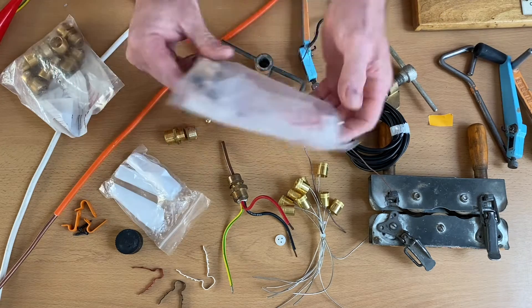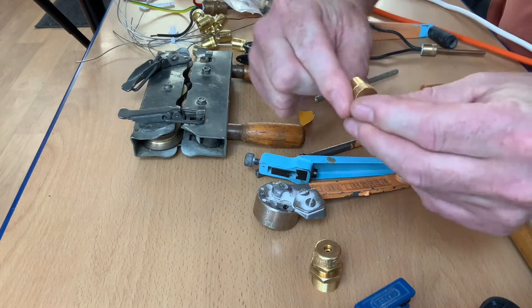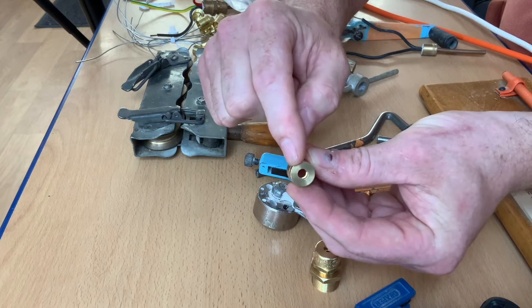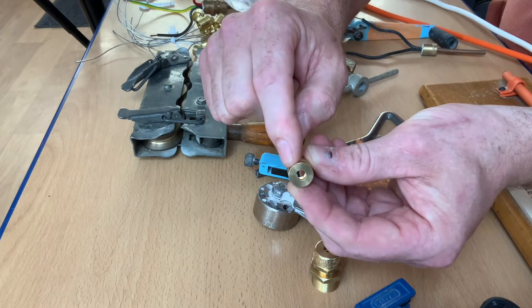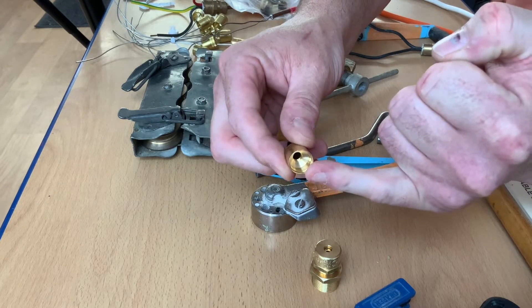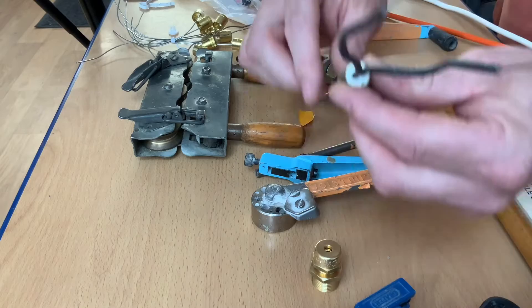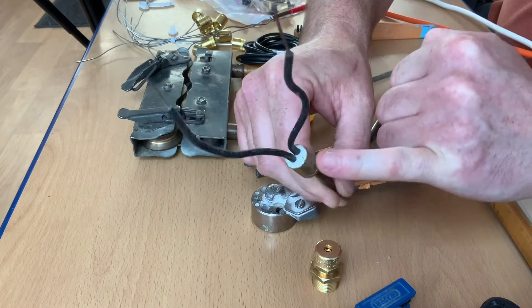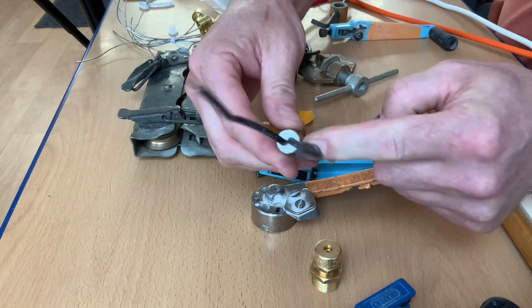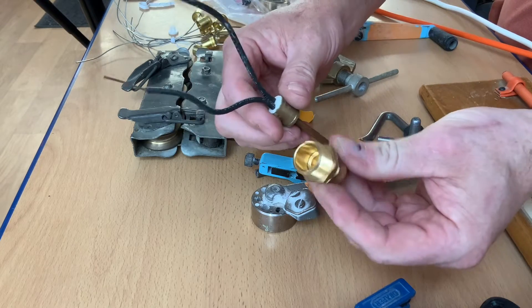Then we've got the pot itself and the disc - we have to make sure they are appropriately the right size. That one is 2L1.5, it's got a little thread inside there that taps onto the cable and holds it securely in place. Then we've got a disc for the two conductors that goes on top. The compound goes into the pot, it's squashed using our crimping tool to squeeze the end and seal it. You can see this pot is actually filled full of compound with some on the outside - the disc is on top and the compound is squeezed into place.